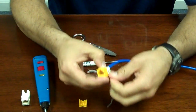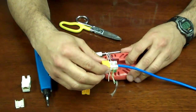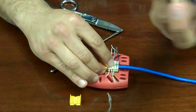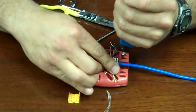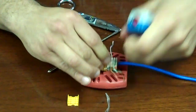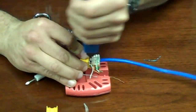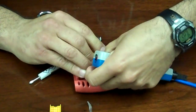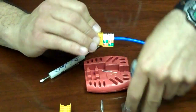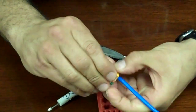Now, the important thing is when you're on a job site, if you have nice desks or walls around, you don't want to punch down on anything nice. So you want to get some kind of a pad — something that will protect the surface that you're going to punch down on. Then basically you take your punch tool and just punch it right down, making sure to use the cut part on the outside of your punches. Now, some people like to do a double punch — you can do that. I find that when you're using Cat5, it's probably easier just to do one punch. Whatever else isn't there, just pull it off. And there you have it. Always check your pairs first before you close up. Take your cover, stick it down in here, and there you have a Cat5e punch.